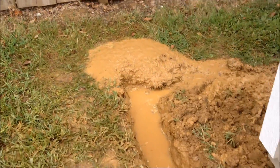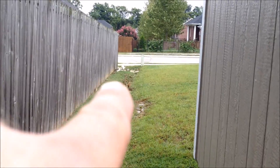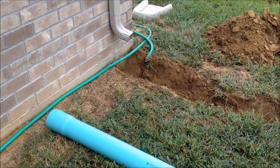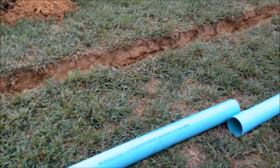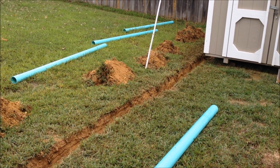Let's get all the way down to the bottom here — you can see the water is all ending up at the bottom. Eventually there will be a pipe down here that I'll tap into, running all the way down to those rocks right in front of the street, where there's a big drain it's gonna go into. I'm really happy. Now I'm gonna go ahead and get the pipe, get it laid in the trench, and start thinking about burying it. Time to start gluing up the pipe — I'll start by putting an elbow up where the drain is, just below the surface.